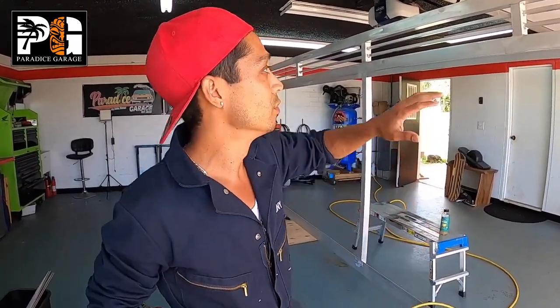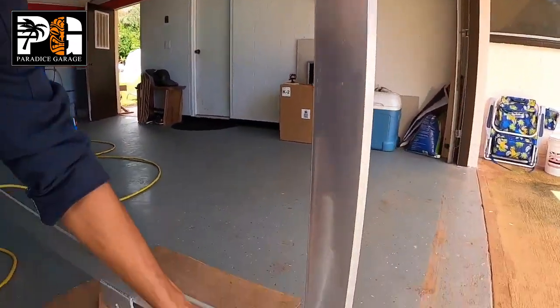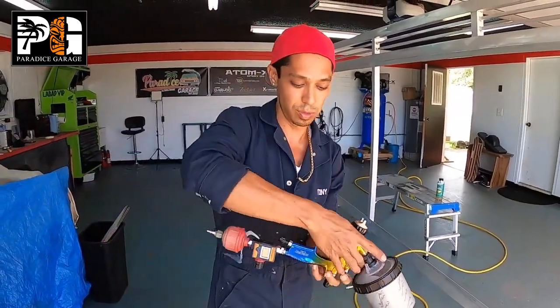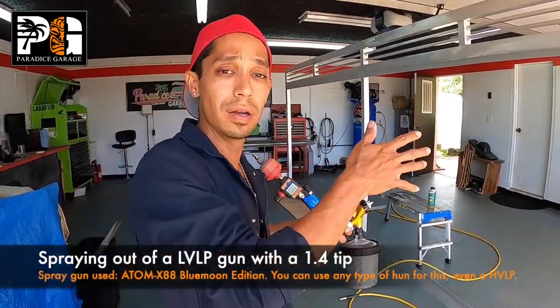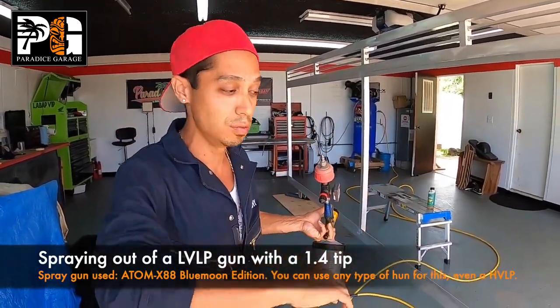We have a 17-foot aluminum frame for an automatic gate and we're going to custom paint it — just gloss black. We smoothed out some of the welds, mostly the corners. Now we've got prepped aluminum and we already mixed up our epoxy primer. We thinned it out a little extra because we're spraying out of a 1.4 tip size. Primers are typically meant for a 1.7 or 2.0 tip, but with the 1.4 and a little reduction we can coat this whole thing.